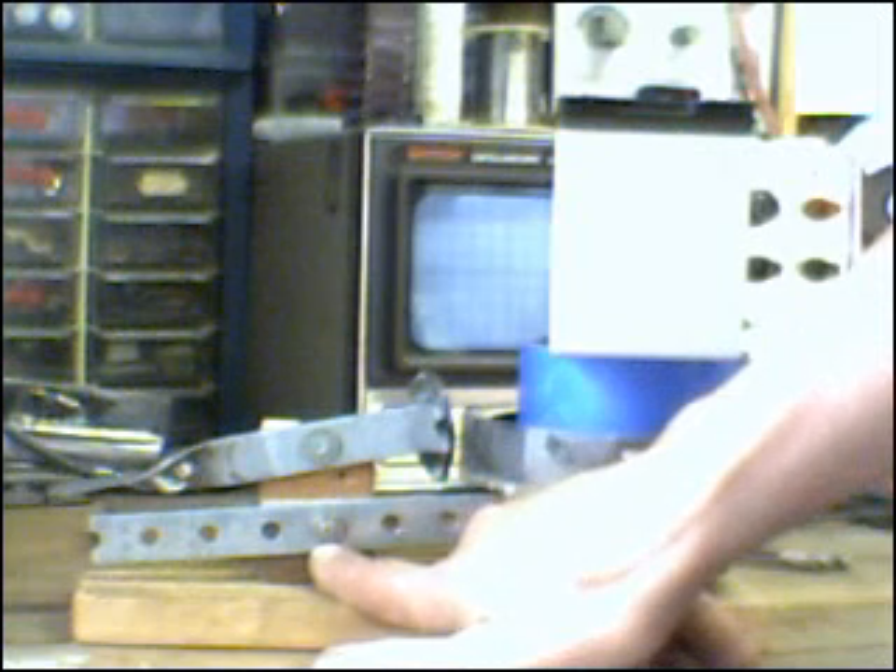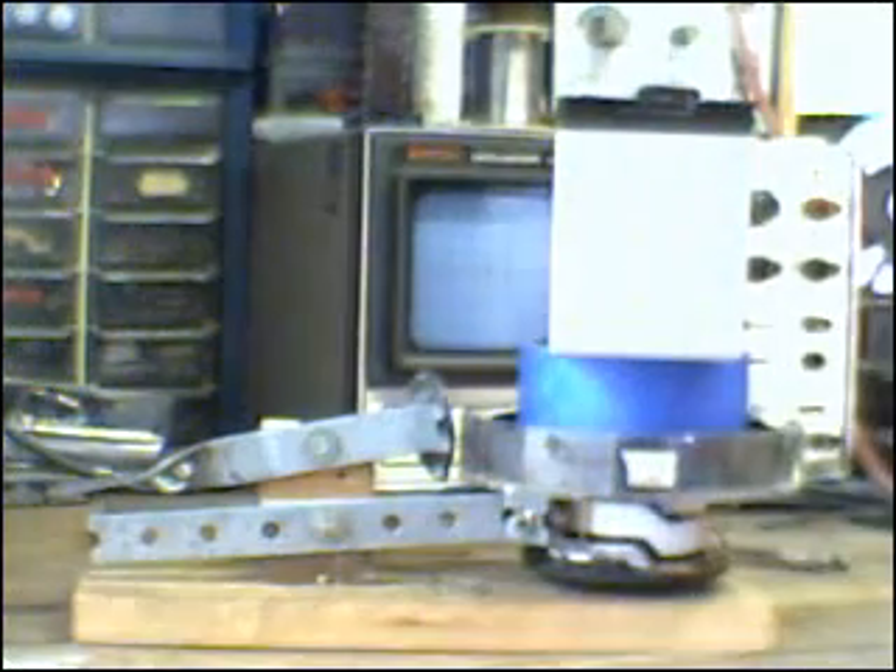This piece of metal strap with the holes pre-drilled in it — I needed to enlarge it ever so slightly with a drill to accept a washer inside that I could use as the pivot point for the fulcrum. Being in a hurry, I took my trusty old unibit, put it in my DeWalt drill, held the metal strap in my hand, and attempted to enlarge the hole. The first step went through very nicely, the second step caught and spun the metal strap in my hand, and ripped my hand open a little bit.